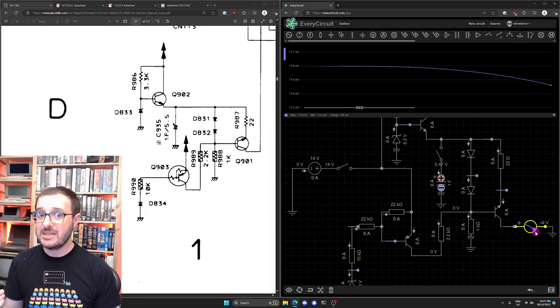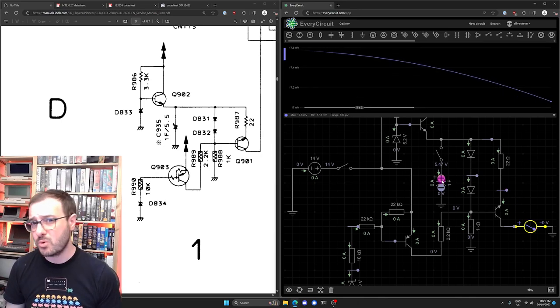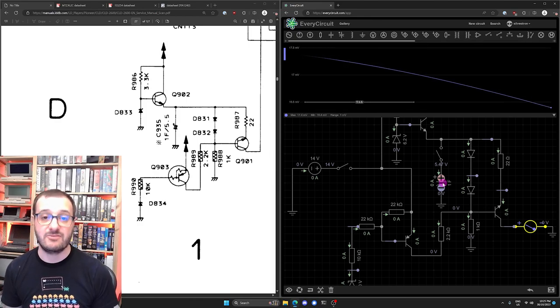Now, in our case, I just want to know if taking it out, or that capacitor being shorted, would cause a problem. I just checked that capacitor. It's actually not shorted. It's gone completely open, so it hasn't failed as a short.